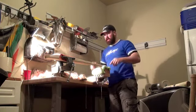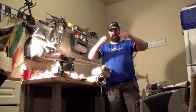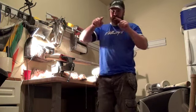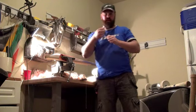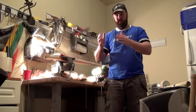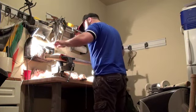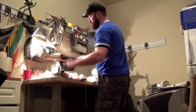Cutting in the ears, which are the two parts of the blade which go in and hold the handle. Just cutting in, leaving a little bit of a rough edge as well. It just helps when you get to the final bind. You're right down at the bottom of the shoulders, so you can take the binding down a little bit lower. Just gives it something to hold on to. Helps you keep everything nice and tight.